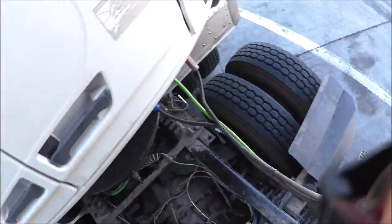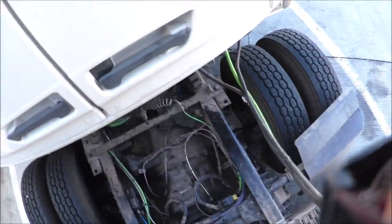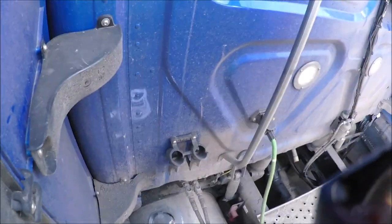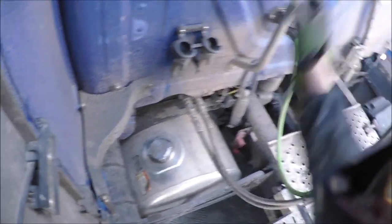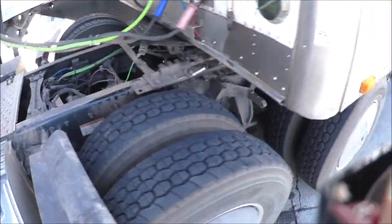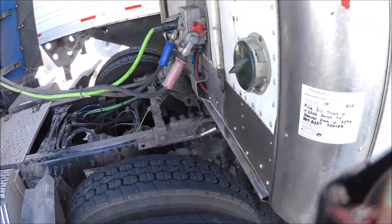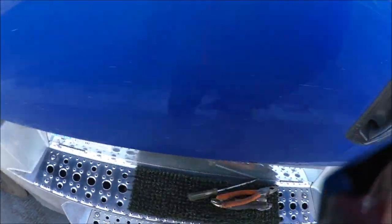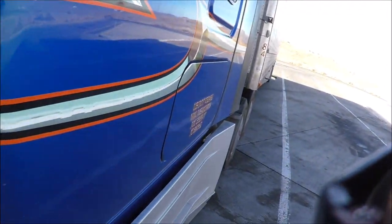I use my screwdriver just to block this from falling down. But this is the leveler bar itself — I'm bringing this back down and connecting it back in the grommet again. Then you want to hook it up real quick because it thinks that it's too high and will lower down. But you see how easy that was. This is it right here, and this is the discharge for the air when it goes down — it takes the air out of the bags. That way I tricked this computer and it shut off the discharge.